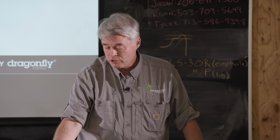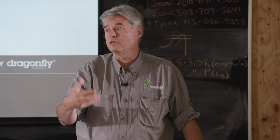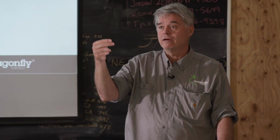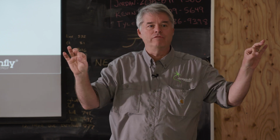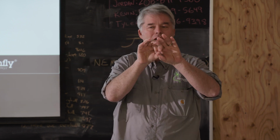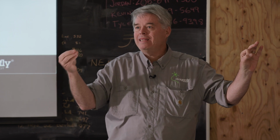The temperature sensor we mentioned can have noise interjected into it, so I use shielded twisted pair cable. You hook up the two wires to that red and black, polarity, and then the shield itself is a metal braid that acts as kind of an electrical protectant around it. Connect one end of that shield.